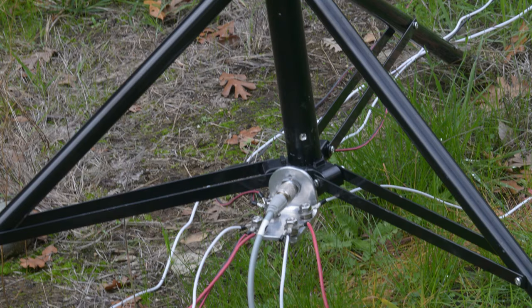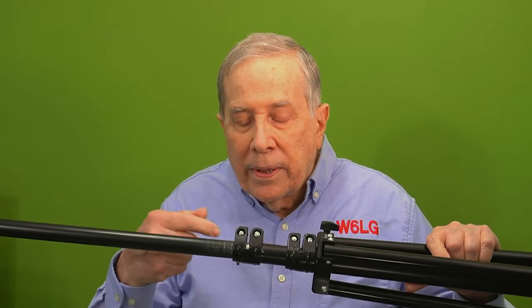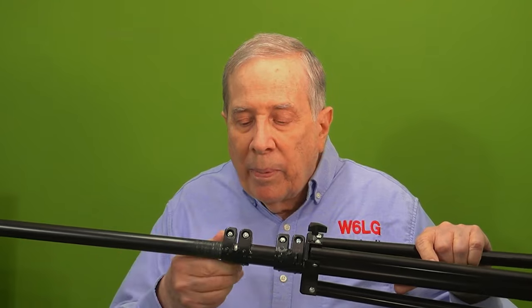I'm going to include pictures of a Rig Expert analyzer looking at the antenna and getting it close to each of the bands. I had some trouble on 20 meters because it needed matching. To make this work — because it is powder coated — I took the bottom of each section out, sanded off the powder coat, and put it back in. A simple ohmmeter test showed it was conductive right to the top. The best approach is to clean off the powder coat and then swap out whips as needed for each band.